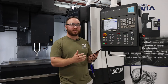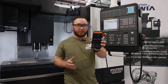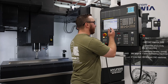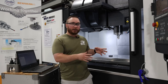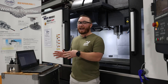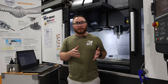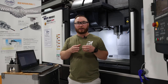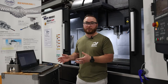Utilizing the GoProbe system, I've got my probe positioned in my bore, and then all I do is tell it exactly what size my bore is and it gives me the macro statement that I can just put right into the control. We've got the ring gauge in there, we've utilized the GoProbe system and the nice app they have on either an Android or Apple phone, picked it up using MDI in the control, and now we have to go into Mastercam and put in the necessary macros needed for Productivity Plus. I'm going to hop on my computer and show you how to do that.